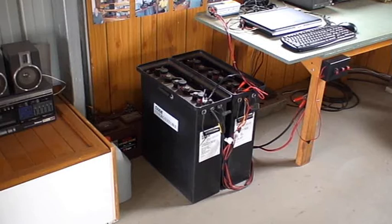This is the battery that powers the radios. It's a pretty large one — a battery this size can power a small house. That's a 670 amp-hour battery, a deep cycle type using lead acid. It's old technology but it's pretty reliable, and it's been running here for four years. As long as you keep the water up to them they're pretty reliable. They say they should last at least 10 years.